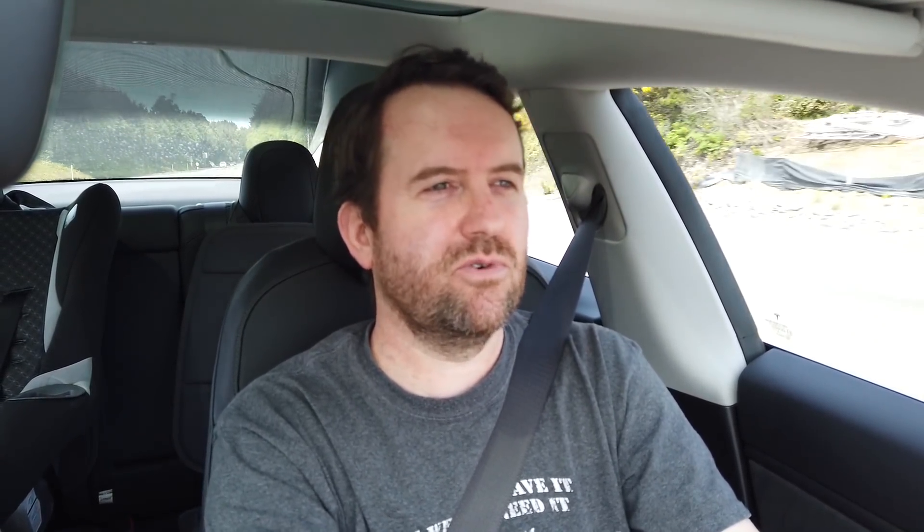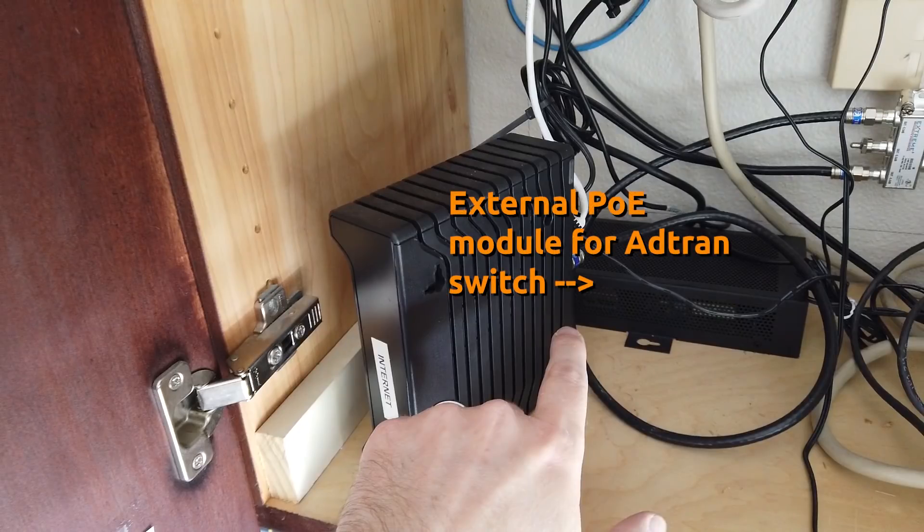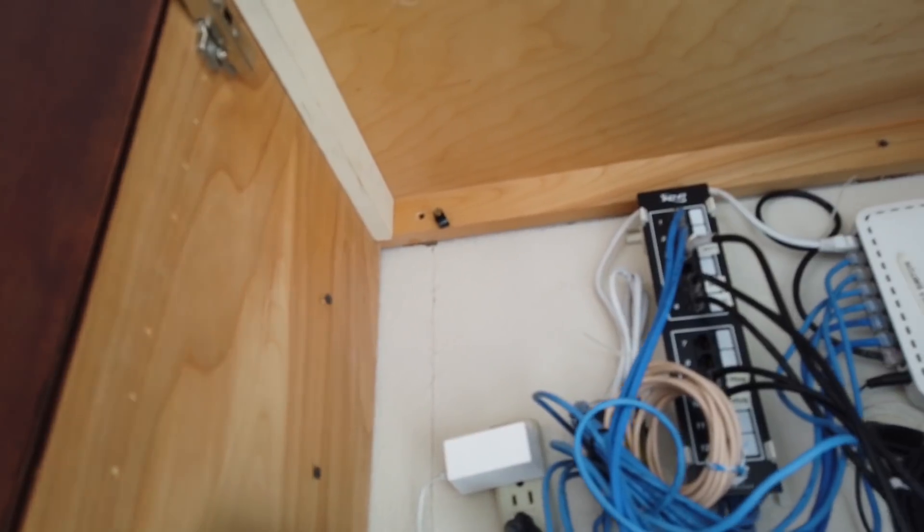That job is done. Total time on site was probably about four hours and we accomplished everything I wanted. All the rest of the stuff — dialing in the phones, dialing in the Ubiquiti settings — can now be done remotely. We ripped out as much of the old junk as possible, including an old AdTran switch that was powering their old phones. It had a separate PoE unit with a secondary Molex connector going into a device with a thin cable providing power to the AdTran switch. The fans were starting to go out on it so I'm glad we got it replaced. The cable management could have been better if I'd spent more time, but cost is always a concern.